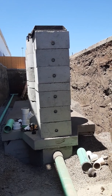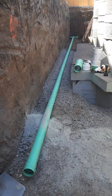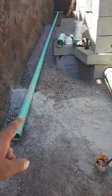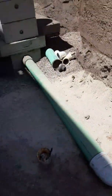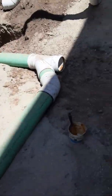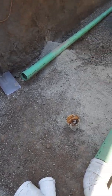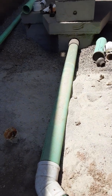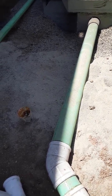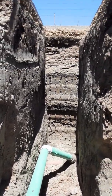We'll grade it down a bit — it has a little bit of grade on top, so it worked out pretty good. This right here is a four-inch sewer, and this is only sewage. We brought it around the interceptor and we're going to put a 45, come over here, and tie in with a Y — basically a Y 45. It's a six by four, and it's going to pick up that four-inch sewer. After the interceptor, this is where we're able to get that water out and into the sewer.